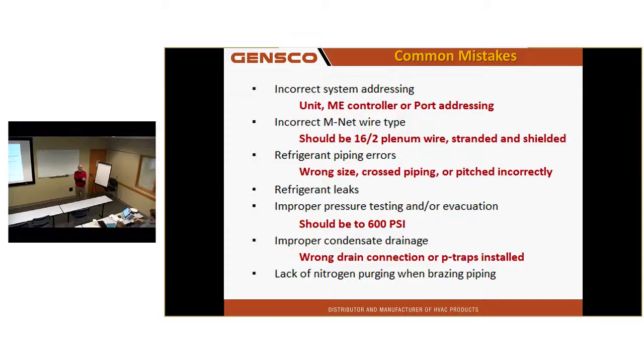If it gets buried behind hardwood, I've got guys that call me, they've got a leak in the system. It's lost its refrigerant. They find the leak, they fix it, but they don't know how much refrigerant goes in the system. Nobody ever wrote that down on the unit. The only way to figure that out is to measure all the piping. And the guy up at Whatcom Community College in Bellingham, it took him 3 months to map his piping. He had no air conditioning for 3 months.